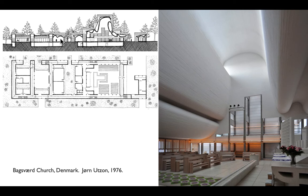If you look closely, you can see these are all concrete. In this section, this shape here is one long vault. Even though it's a strange section — it would never work as an arch in the short direction — that's not what it's doing. It's working as a beam, spanning from bearing walls on one side of the church to bearing walls on the other.